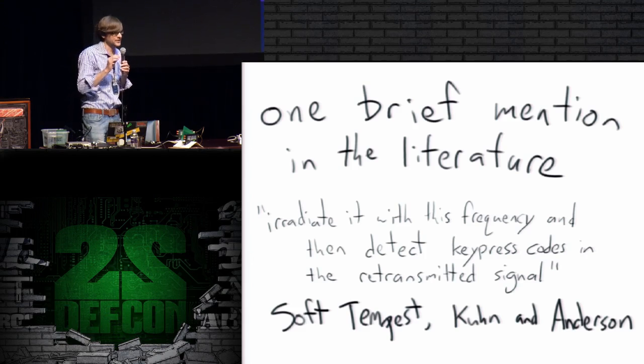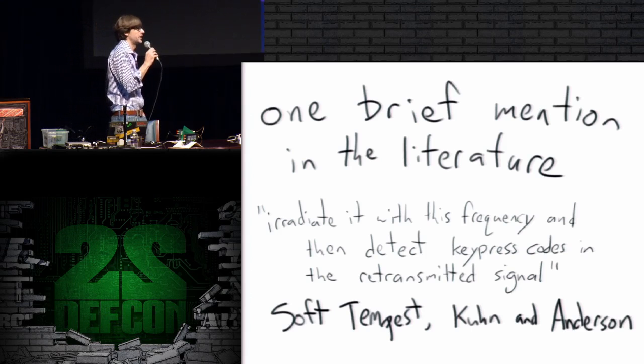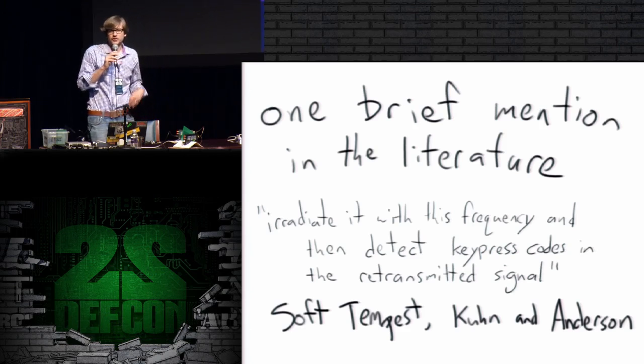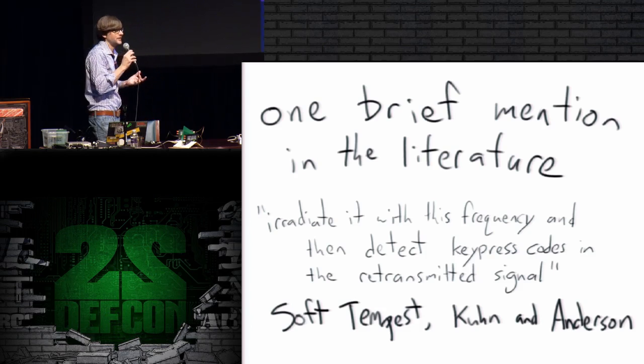And there are some hints in the ANT catalog that suggest similar attacks are possible on other things. For example, there's a VGA video implant that is a retroreflector for picking up the video signal. And on the page describing that implant, it says that it provides an enhanced return, which suggests to me that they get some kind of return sometimes from VGA cables without enhancing it. That's very interesting, I think.